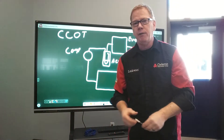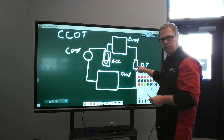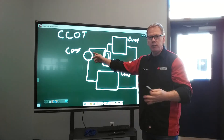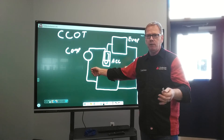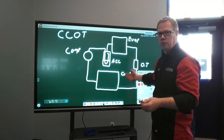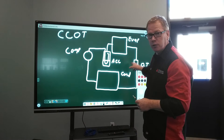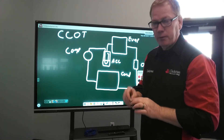In the event that there's a catastrophic failure in the AC system, most of the debris you will find at this location right here. If you do have something fail — and in most cases it's a compressor, that's the only really moving component in this whole system — if it starts to come apart or pieces are starting to degrade and get transferred into the system via the refrigerant carrying it, then that debris will be carried through the condenser itself all the way to the orifice tube, and at that point it will get trapped in the screen. So if you remove a compressor on a car because it needs to be replaced because of internal damage, you need to make sure that you go to the orifice tube and remove it as well so that you can replace it with a new one because of all the debris built up on here.